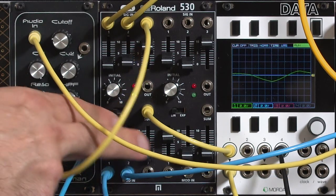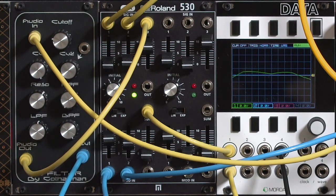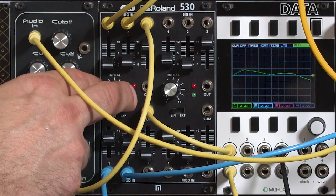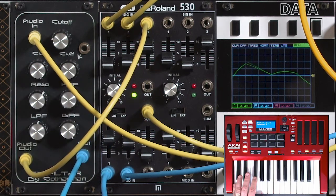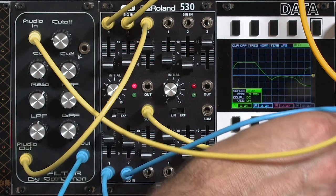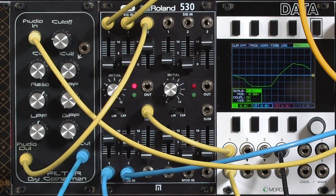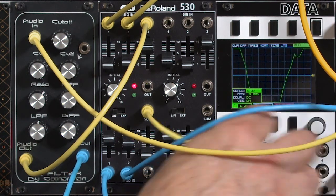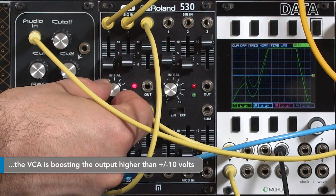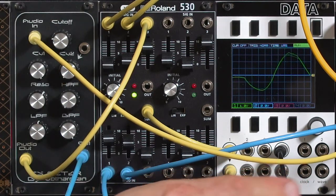When you add together three different audio signals plus three different control voltages and this initial setting, it's very easy to overdrive the VCA. What's interesting is that the VCA itself is very clean — what seems to be clipping are the output voltage rails. There's a limit to how high of an output signal this Eurorack module can produce. If I crank this up all the way, you can see where we're clipping on the display. At five volts per division, you see the clipped waveform — just under two lines at five volts a line, it's about plus or minus nine to ten volts, which is pretty standard for a Eurorack module. The VCA itself is very clean — if I just pull down the initial level, you can see I can get rid of the flattening or the clipping. So it's not the input mixer that's clipping; it's the output side that I'm driving too hard.